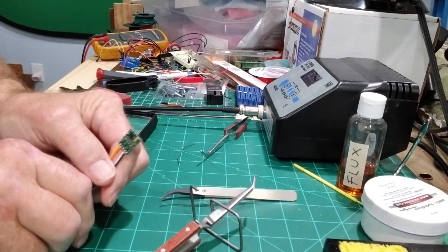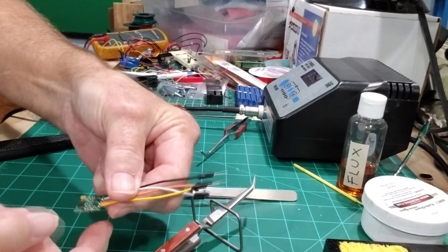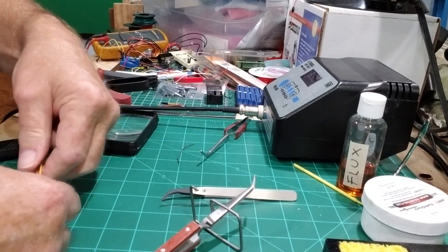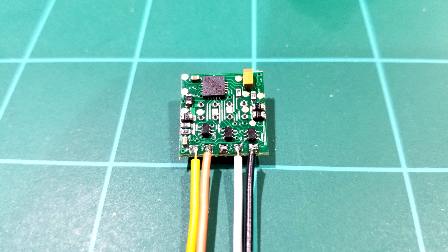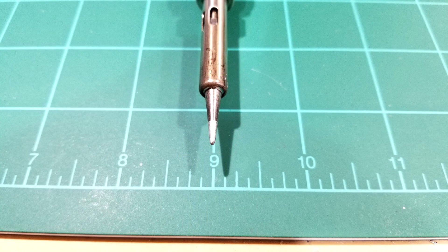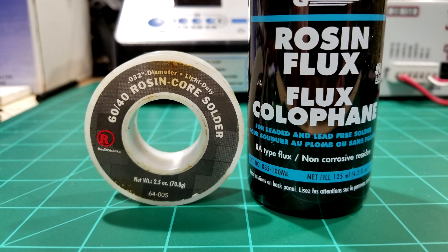Now I have the four wires on there just like that. We have our pins over here and this is going to sit on the tester like this, so we're going to have to bring these wires around back that way. Here's a view before I soldered it — as you can see it's less than five-eighths of an inch square and the pads are pretty small. Here's the view after I soldered it — you can see the four leads I put on there. The center lead is for the common blue wire, which I will put on whenever I need to put this on a locomotive. When soldering small items like this, you want to use a pointed tip and the smallest tip you can find. I normally use a small 0.032-inch diameter rosin-core solder for small projects and a larger size solder for bigger wires.